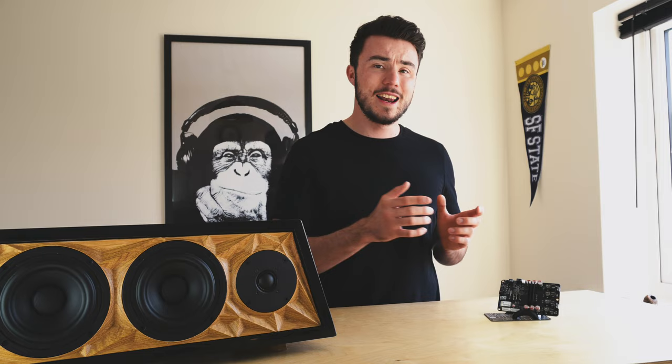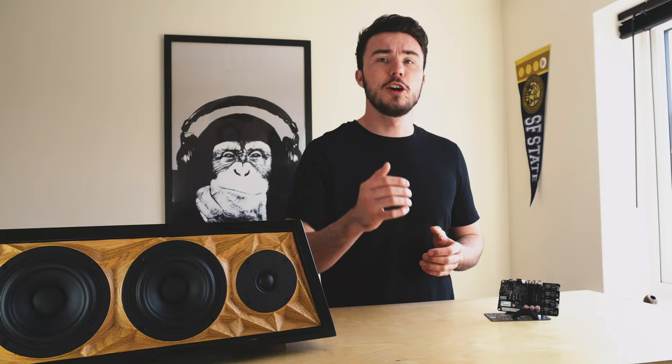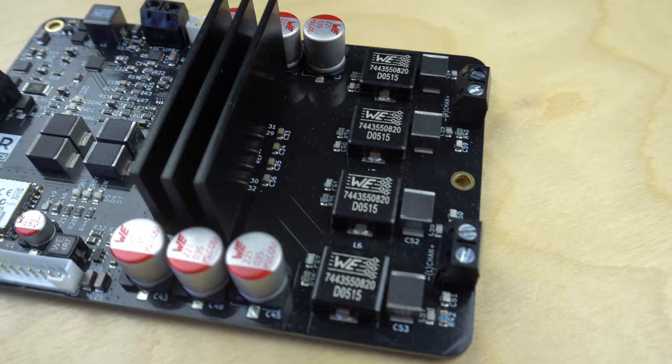In my design I elected to use the TPA3116 for its low distortion, power efficiency, and frankly ease of use, since in the datasheet they had a super useful circuit diagram of all the supporting components needed. It's not as easy as simply copying the design though — changes had to be made based on the speakers you're planning to connect and the settings you want in terms of gain, power limits, and fault detection. Let's start with the output stage, which is the part of the circuit to the right of the chip.